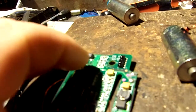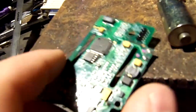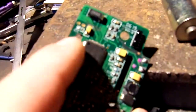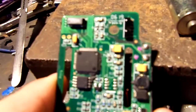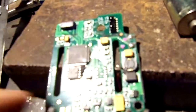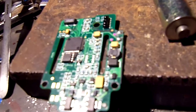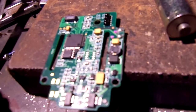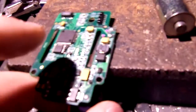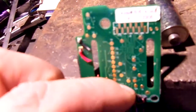I don't know if there's an encrypted connection between the keypad and the reader on the non-Bluetooth versions. I'm sure the Bluetooth versions use Bluetooth encryption. I know it's two-way communication — a dual communication link. With this having a battery and likely a clock circuit, I'm guessing every transmission is probably time-stamped, so you couldn't just capture one infrared transmission and resend it — if the timestamp didn't match the device's internal clock, it would probably just reject it.